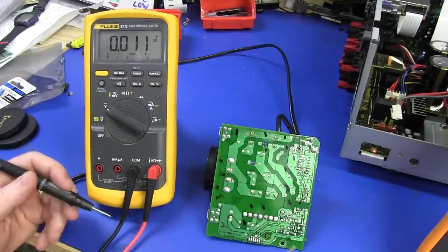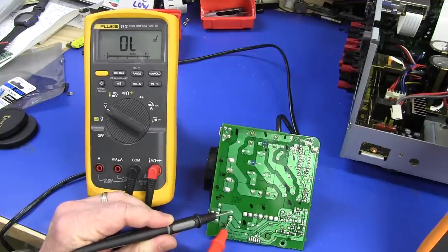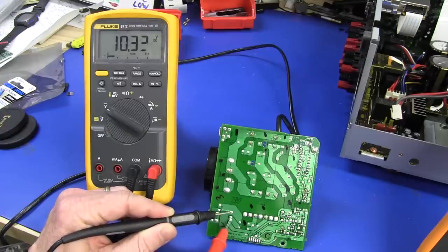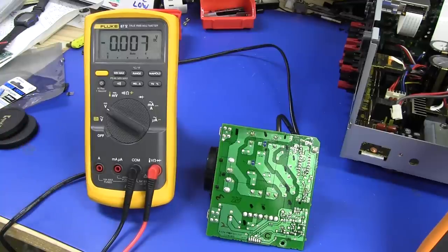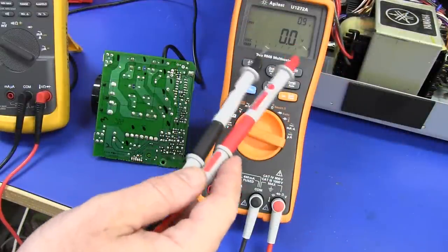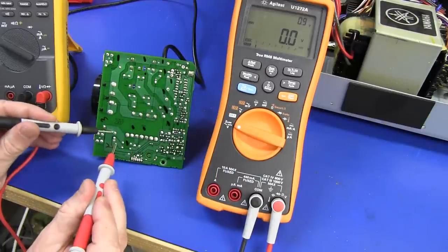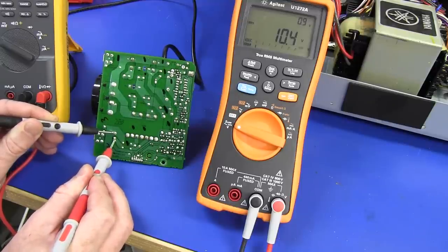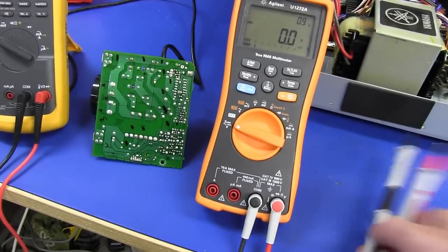The other thing needed is 12 volts to drive the relay over here. This output should be 12 volts - let's check. Oh, 10.6 volts - that's jumping around a bit. That's suspiciously low. I would have expected 12 volts because this is a 12-volt rated relay. Maybe if I check the service manual schematic it'll say. I'll try to load it down and see if that drops. Using the Agilent 1272A in low impedance mode - it's still 10.5 volts. That would still be enough to pull in that relay though.